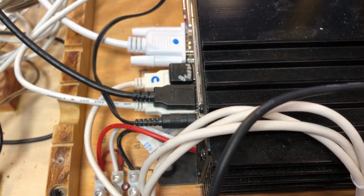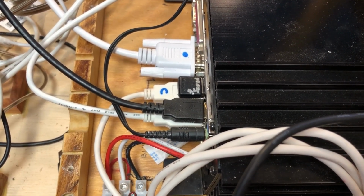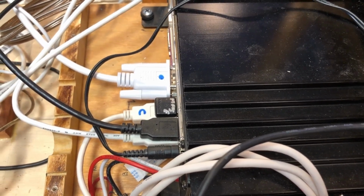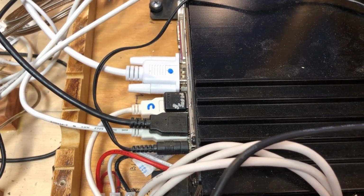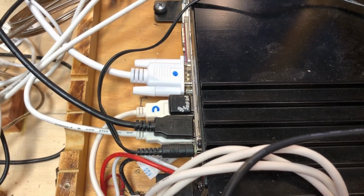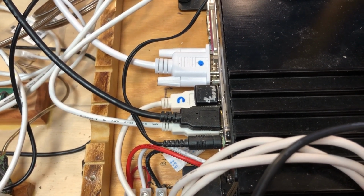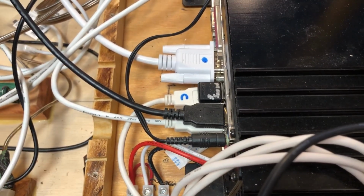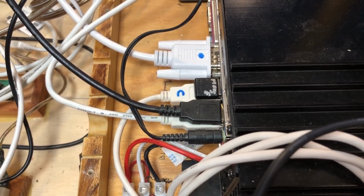And this was designed as a car computer, so it runs off of a single 12-volt power supply. On this particular computer, the power supply is inside of it, so you're supposed to just be able to hook it up to a car. And car voltage, if you're just running it off battery, is 12 volts or lower. But with the alternator running, with the car engine running, it can get like 14.6 volts. So the regulation for that power supply is inside that box. There are fans in there. They're very small and they're very quiet.